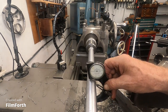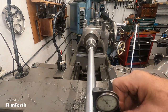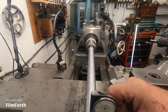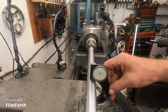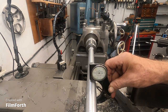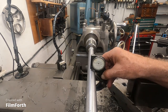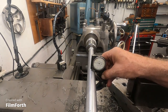It's hanging close to zero here - maybe a thou over. Looking from a thou over... yeah, this doesn't have to be the most accurate measurement, and you're not going to get great accuracy on old hot-rolled steel either - it's just gummy, slow stuff. It's still on zero, within a thousandth of zero.